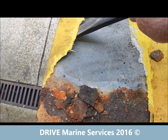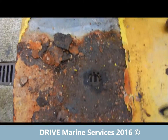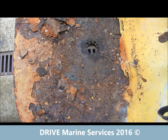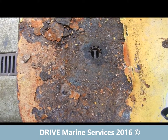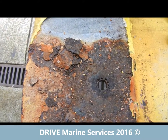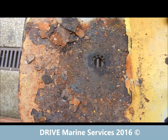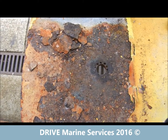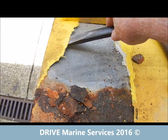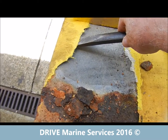Another thing to note: they've used polyester resin and some chop strand mat over the galvanized steel — they might as well not have done it. Polyester resin is a very poor adhesive, and it could be part of the reason why this has rusted. The salt water got in and sat underneath the fiberglass, wouldn't dry out, and it killed the galvanizing. We're just going to use some U-Beaut epoxy paint — the Aquacoat epoxy paint — to tidy this up. We're not going to put any coating over it; better off just leaving it as galvanized.